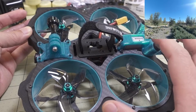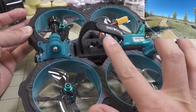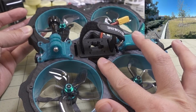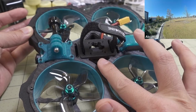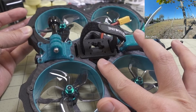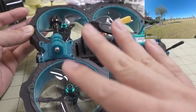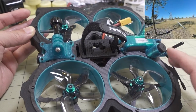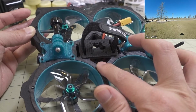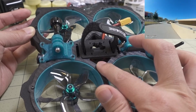The boards have that style in terms of the way the solder pads are and everything. So you have an F7 flight controller. I think it's got 5 or 6 UARTs, MPU6000 gyro. Basically, it's an F722, a fairly new one. It has a barometer as well. So it's a fairly modern flight controller for the end of 2020. In fact, I think the latest and greatest right now is the F722 or the F745. And then you've got a 35 amp 4-in-1 ESC. It's a 32-bit ESC, 35 amps up to 40 amps bursting.